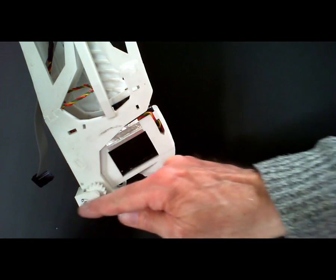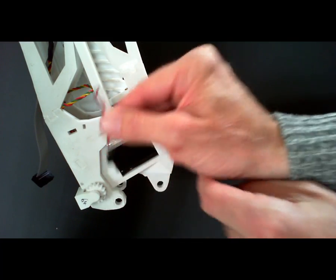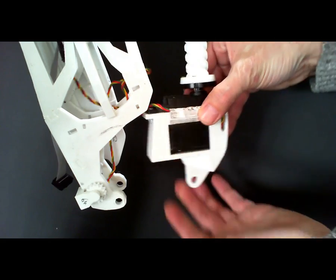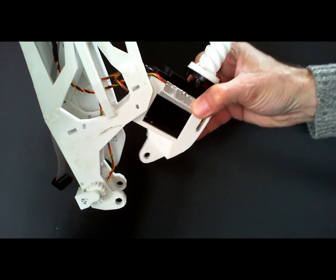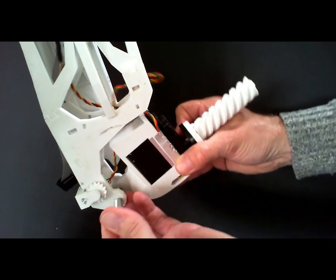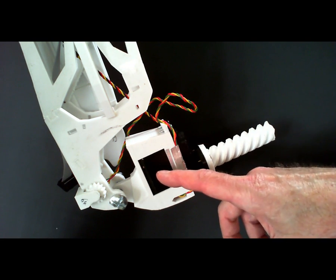Ideally, set up the potentiometer on the back so the wires can run up more easily. Assuming you've already fixed the potentiometer behind and the gear is mounted, what we want to do is test if the polarity is set up correctly. To do this without breaking anything, remove the piston from the bicep and use the bolt normally used to hold the forearm to keep it from hanging on its wires.